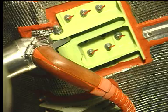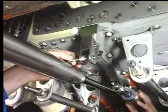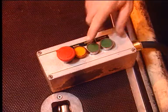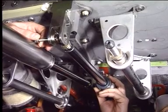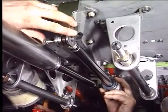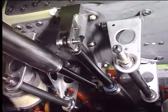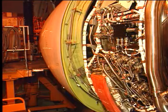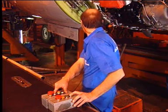Then reinstall the protective shroud. On the opposite side of the engine, gain access to the opening actuator hinge beam on the pylon. Using the hydraulic service unit, extend the opening actuator rod to the hinge beam, align and attach it. Next, close the thrust reverser cowl door by operating the hydraulic service unit.